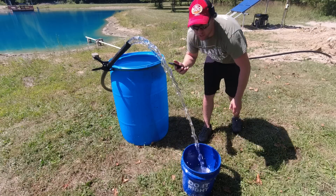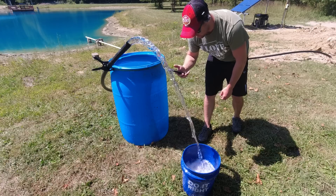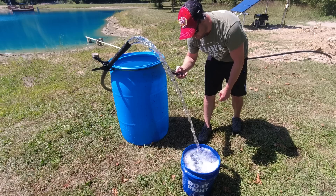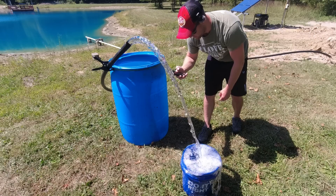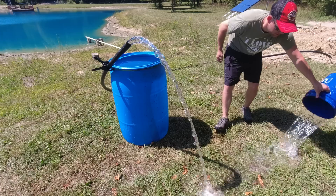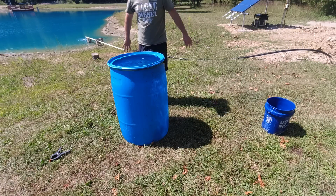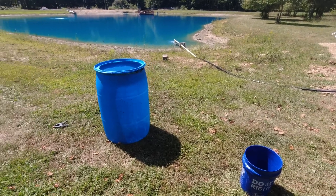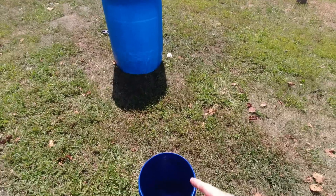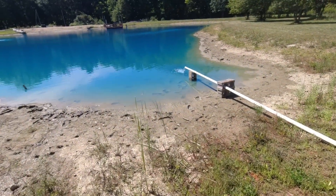Five gallons in 14.47 seconds. We'll do it one more time. 14.39 — man, she's consistent. Let's get this back in the water before we make a bit of a mess. So the five-gallon bucket mapped out to be about 21 gallons a minute; the longer test was 22 gallons a minute. I actually trust that more over longer term — less of a fudge factor when you're pushing start-stop. So for the sake of argument, let's call it 21 and a half gallons a minute.